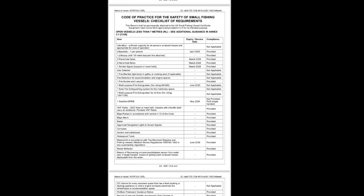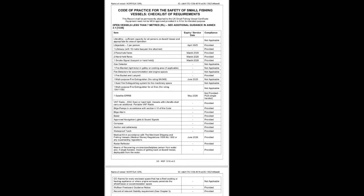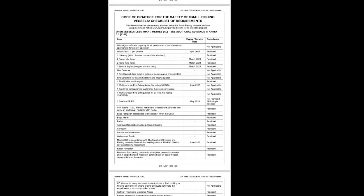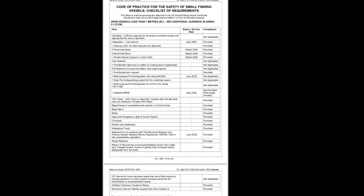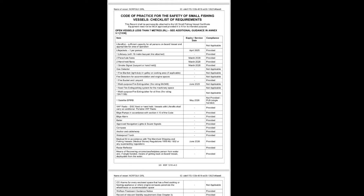Some boats — a lot of tackles have got the old self-draining decks with like the old elephant trunk sock on the back — well, they're a big no-no now. So in October last year I cut a well in the stern of the boat and fiberglassed it in and put a bilge pump in it, so that's all right now. But yeah, everything's pretty much the same.